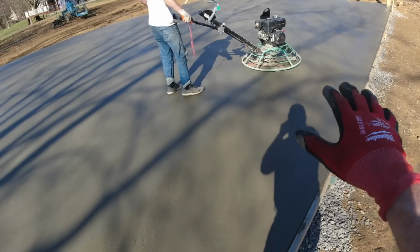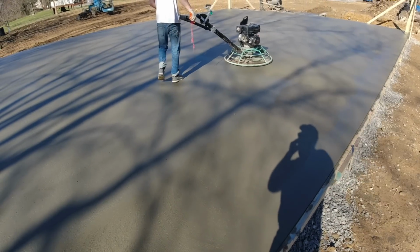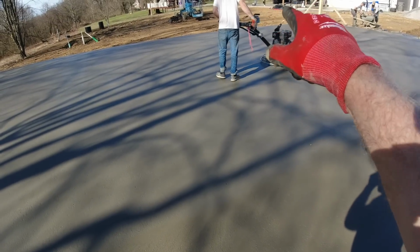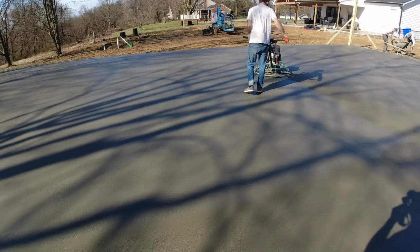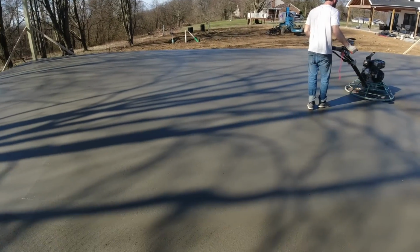And just truing everything up, slow and flat, right? I say it in almost every video. Same applies for that. As the concrete gets harder, up the throttle, higher pitch of the blades, and away you go. This is about 1,800 square feet.